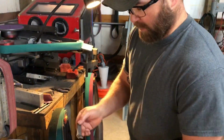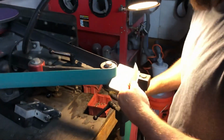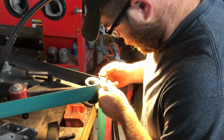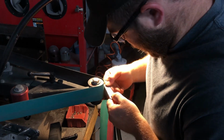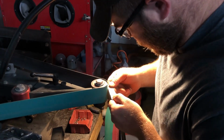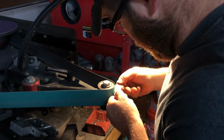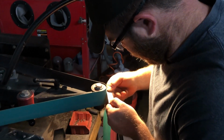So now I'll go over to a 220 grit belt and clean up the spine, make it look nice. Run it on the horizontal on our trusty Wilmot. We're doing another job here, so I'll pull this work rest off. I'll just freehand grind it. Checking frequently to make sure that I'm keeping it perpendicular to the flat, and I'm not creating a bunch of bobbles and little dents and divots in the spine of the blade. Running the wheel fairly slow, knocking out those 60 grit scratches.